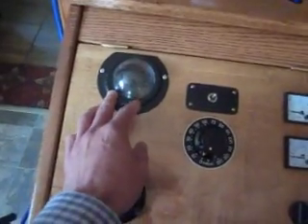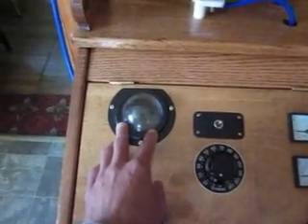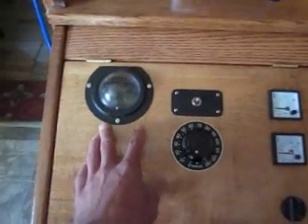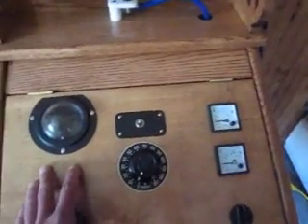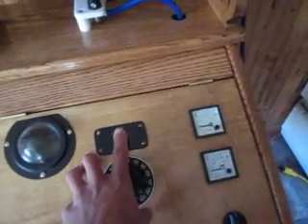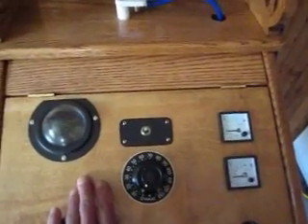This is basically just a glass dome so I can see the spark gap working. The spark gap is a three-point serial spark gap. Original devices have a manual knob to regulate the spark gap distance; I decided to make it motorized. This momentary switch can go in either direction — it has a gear motor which pushes and pulls the points apart and together.